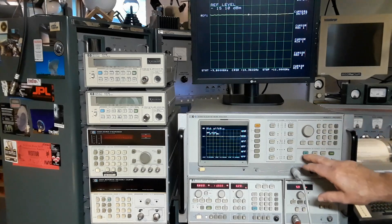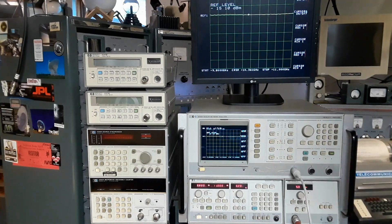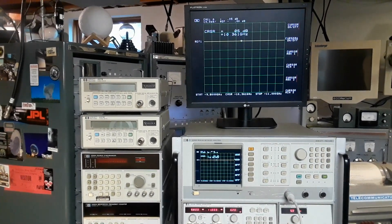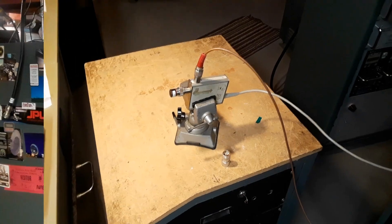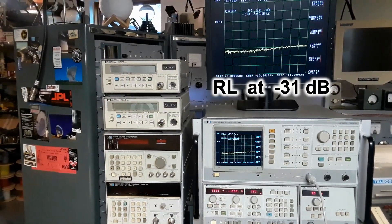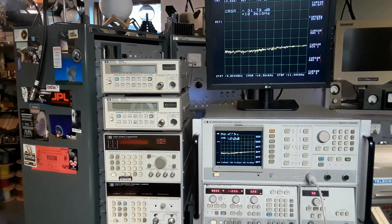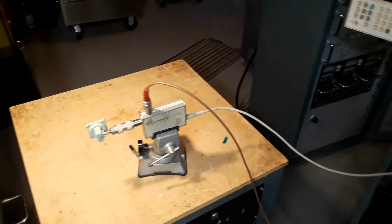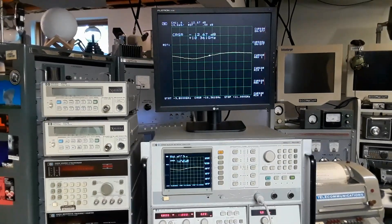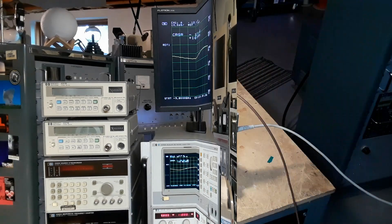With just the RF bridge connected, I turned on the RF output module and started setting things up. I wanted to zero it out so that I have a reference line of zero dB for the return loss. It's been a while since I've used this thing and I had to sit there and think about what to push and what to adjust. Once the unit was zeroed out for an open circuit, I put a 50-ohm termination on there just to check that things are working right — I knew it was a good termination, and the return loss came in around negative 31 dB, so it looks good. I then installed the waveguide SMA transition piece and swept it — nothing special but nothing outrageous either, kind of wide, around negative 12 dB, which is what I kind of expected.